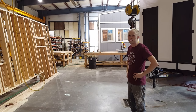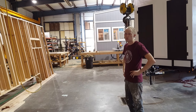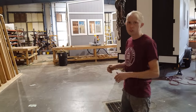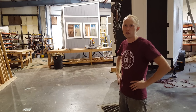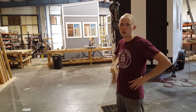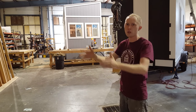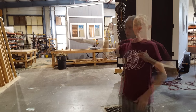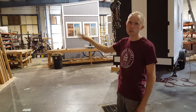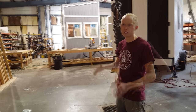On the webinar this morning you were talking about how your trailers are made specially, particularly because of the plumbing — the plumbing and structural integrity. What we do is we have jacks in the middle and jacks on all four corners to ensure that the house is perfectly leveled when we frame, so nothing is tweaking around while it's getting framed.